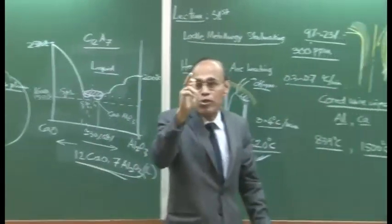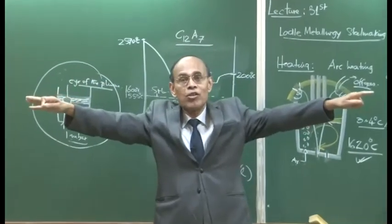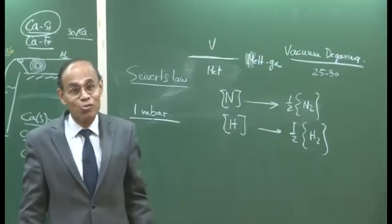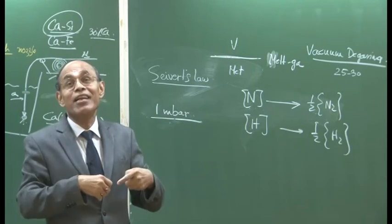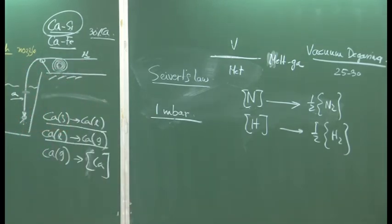And there, the moment we stop argon purging here, the entire slag is going to be covering the molten metal surface, and as a result, the condition that the melt will be able to see the vacuum is no longer going to be satisfied. Even though thermodynamic conditions are favorable, because of this kinetic barrier, there is going to be no removal of nitrogen or hydrogen.